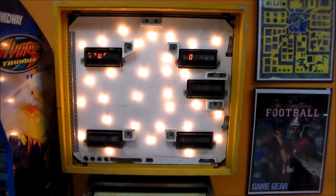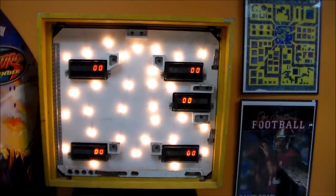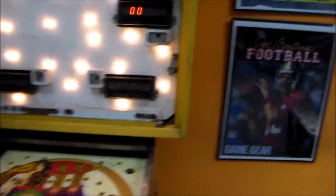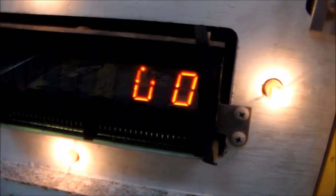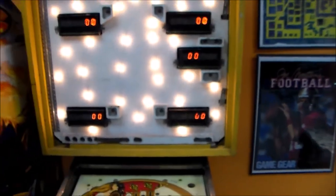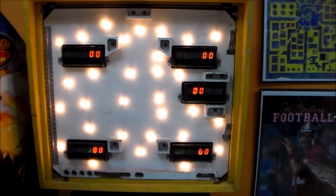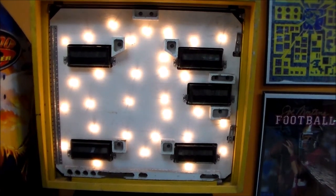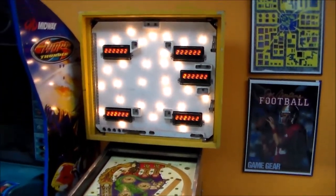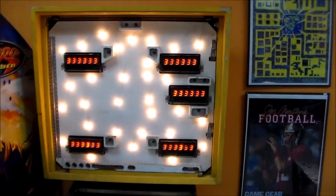We got all the voltages right, and it sends voltage over to the MPU board. I had an MPU board that was already working — popped it in, plugged it in with a good connector already there. That's the connector for the displays and this is the connector for the cabinet switches. We plugged all that in, then plugged in the light board. We've got a couple of wires not completely connected yet so the lights aren't fully up and working, but we basically now have the whole powertrain working with the MPU board in it. We went through our stash and found displays we'd previously tested and labeled as working, replaced a few resistors, and replaced missing or burned-out light bulbs — leaving that one original dusty bulb in since it made the trip so long. We'll turn it on and see what it does — she boots up. It's up and running. It doesn't have the soundboard plugged in yet, but we'll get one. One display down here has a little bit of burn — if the voltage is too high it'll burn the displays like that. We put that one in the fourth player position since it gets used less. We'll put it in display test mode — all good displays. Got the general illumination lights in the back box working. Got most of the boards in. Still need the soundboard. The play field is just a bare piece of wood with nothing hooked up yet, but we are getting there. Progress, progress, progress.